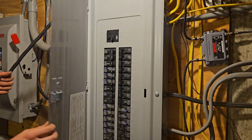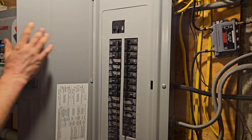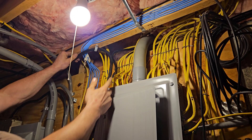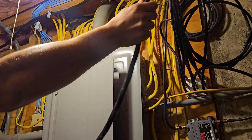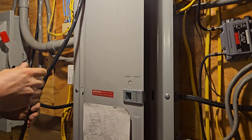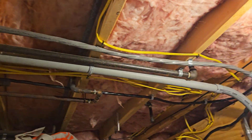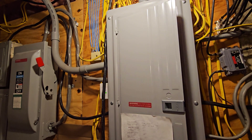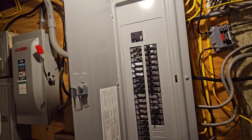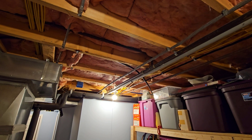I don't know which side of the panel box I'm going to go in until I take off the cover and see where there's more room available to go through a knockout. So I put my last strap here and I'm either going to tuck into the box on this side, or put another strap and come down on the other side. In the next video, you'll see this with the cover off and I'll show how I installed this wire into the circuits. After that, we are going to show running the wire into the panel box and installing the breaker, and then installing the receptacle on the other end.